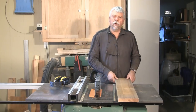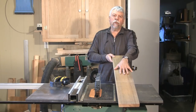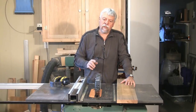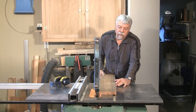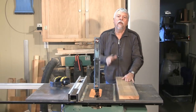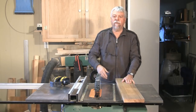After you've trimmed all of your boards to length, the next thing you're going to need to do is trim them to width, and we do that on the table saw. Before we get started, it's important to remember that the saw blade wants to be a quarter to a half tooth above the material, and we do that both for a better cut and for safety reasons.